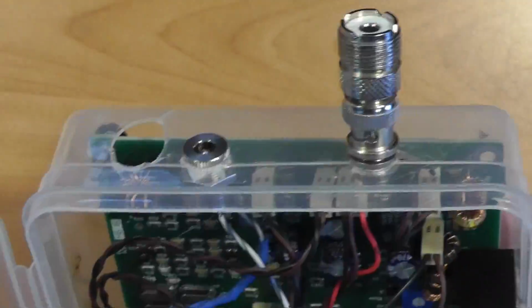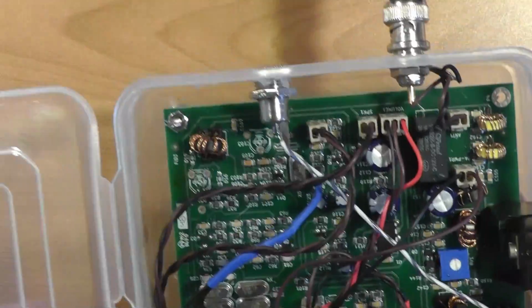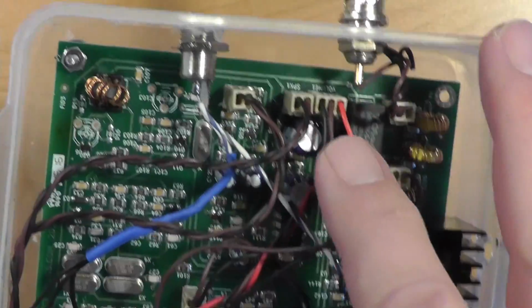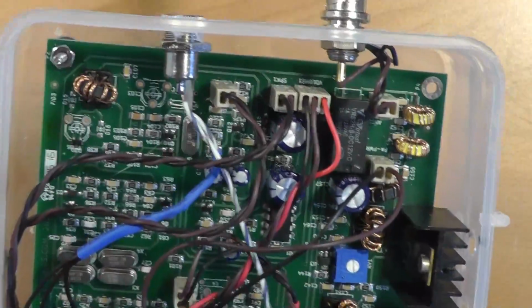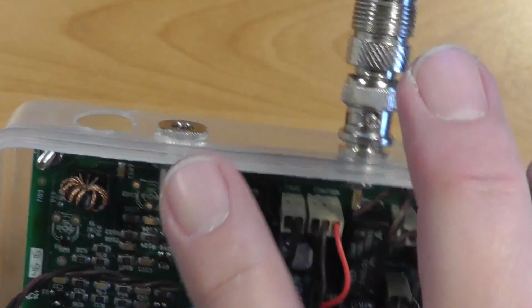The BITX-40 comes without a case, so I opted to use the plastic box everything came shipped in as a test bed. In terms of assembly, the job consists of soldering provided leads to the external components and then plugging them into the circuit board. No soldering is required on the board itself. The list of things that need to be soldered and then plugged into the circuit board include the following.